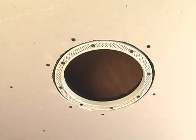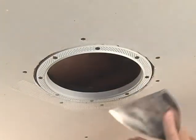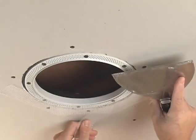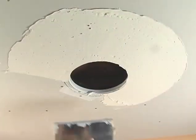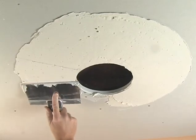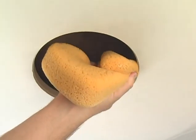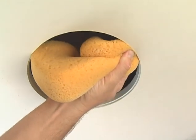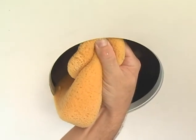This is how the bracket assembly should look for your drywaller, ready to mud. Use mesh tape with hot mud or paper tape with regular mud. Apply mud to the mud ring in a circular pattern and feather to the edges. When the mud is dried, clean off the inside lip of the mud ring. You want this as clean as possible before installing the speaker.